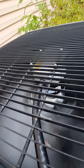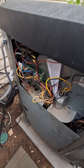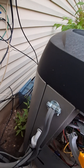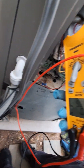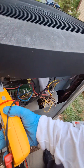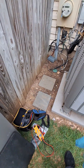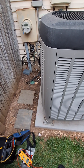Full load amps is 2 amps and we're drawing only 0.96 — we're good. Nice and quiet. We'll let it run, close this off. Total amp draw is 9.7. Going to close this up, get some temperature readings downstairs, put the door on, and that's it.